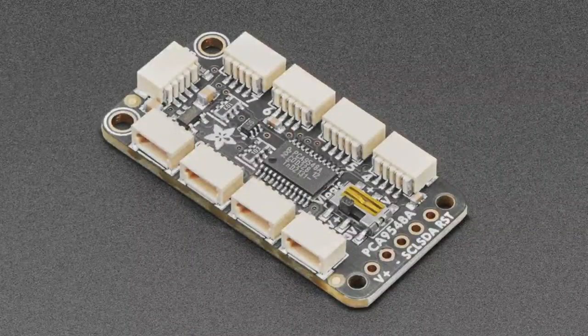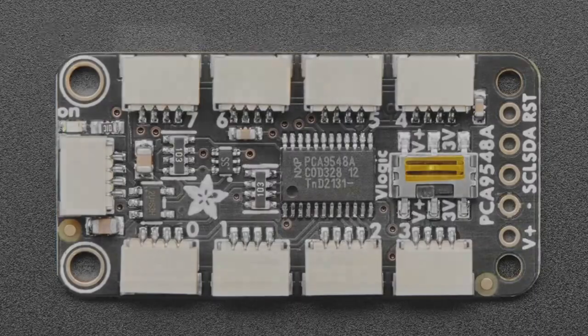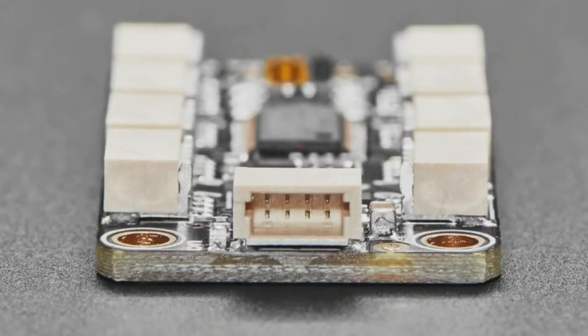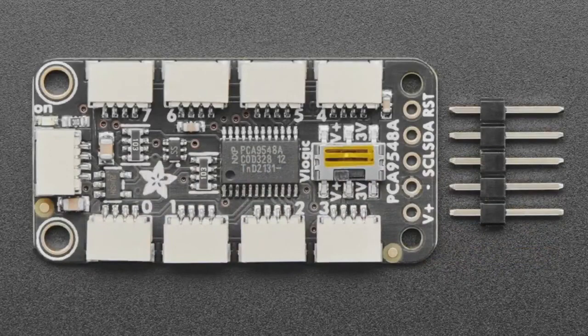And let's say you want to have multiple distance sensors because you're making a laser harp. What do you do? Well, this is a special chip. It's very inexpensive. And you have one port, and that's the one on the very left. That's the input port. And then when you send a special I2C command to address 70, it tells that chip to route the next I2C commands over to that port. So there's 8 ports, and so you can select which port you want to route to.